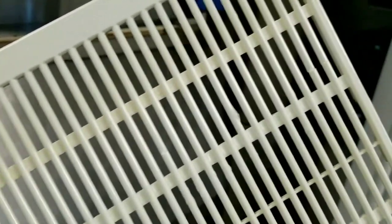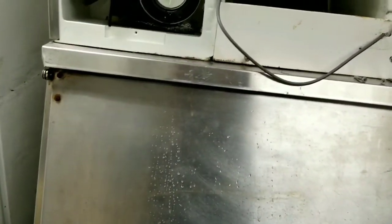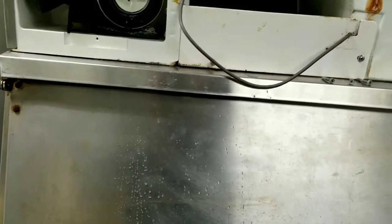This is just plastic. It wears. It's really bad design. But get these pieces like that caught in the pump, you can burn up the pump, or sometimes the pump can come back. So what we gotta do is we gotta replace this ice guide, and possibly the motor, who knows. I'll put it all back together and see if we get some pump action again.